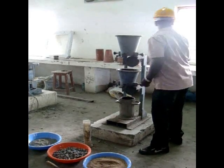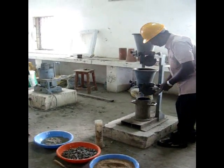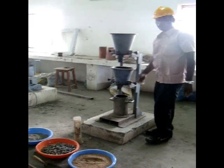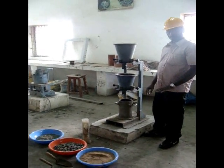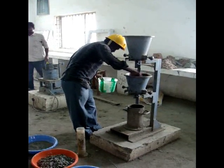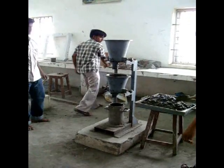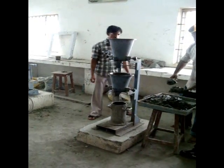The top hopper, the second hopper, and the cylinder should all coincide in a line — check the alignment. Close the lids of the bottom hopper and top hopper. Apply lubricant on the top hopper, bottom hopper, and cylinder so there is no sticking of concrete. Keep the fresh concrete nearby and using the scoop, fill the top hopper.